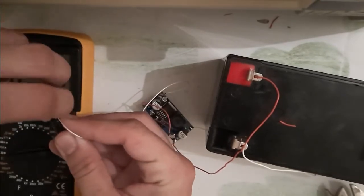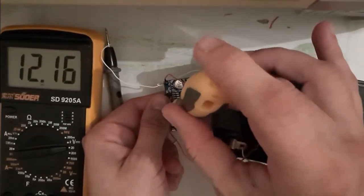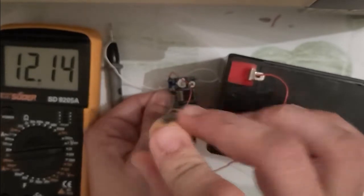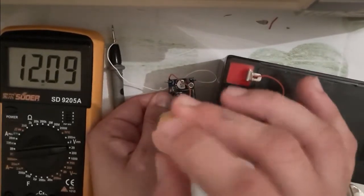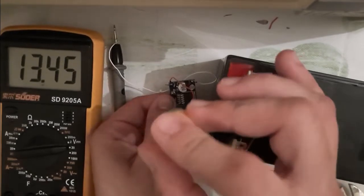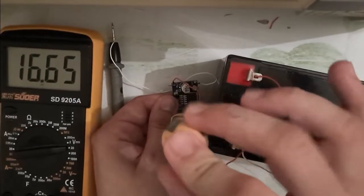As I told you, this is a step-up voltage. Let me try it now. I will turn the potentiometer and see what happens on the multimeter. I'll turn and turn to reach 12 volts — I should reverse my turn. As you can see now, it's going above 12: if I want 13, 14, 15...